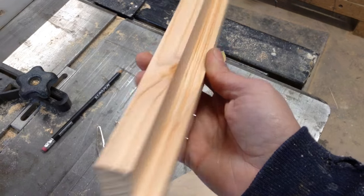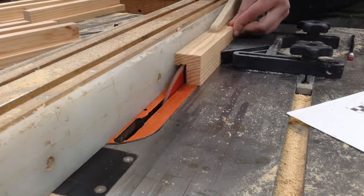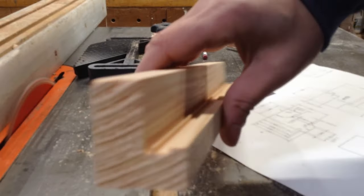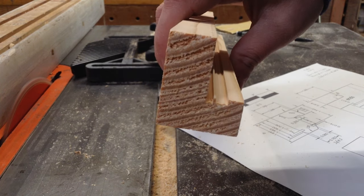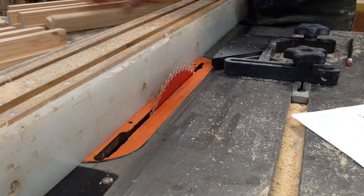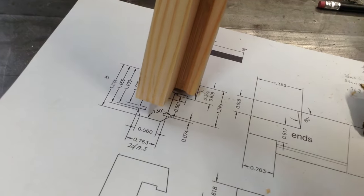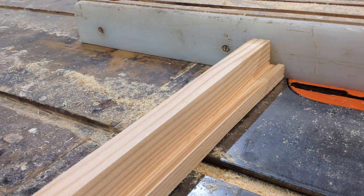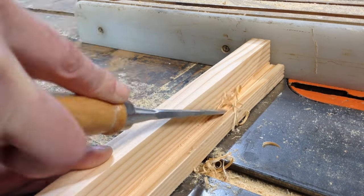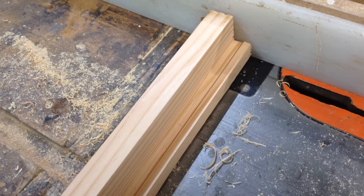The reason I'm making so many blanks is that if you're making this in real life in your own shop, there are a lot of cuts and a lot of chances to make mistakes. If I was making this for someone, I'd be making all of these shorter pieces and testing out all my cuts on them — if you mess one up you can toss it aside and still have a nice stack to work with. My goal was to make a one-by-one square frame to make sure all of my setup was accurate enough to recreate a smaller version of this window. I used about four kerfs to remove all of this material. There was a little bit of raised material left, so I went through very quickly with a chisel to clean up the bottom of that joint, but this is going to be getting silicone and glass so if the bottom's not perfectly flat it shouldn't affect the build.